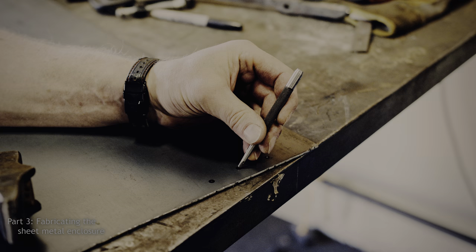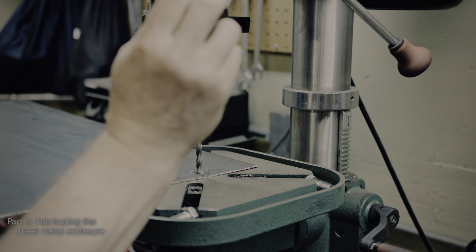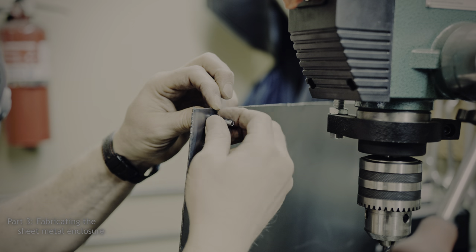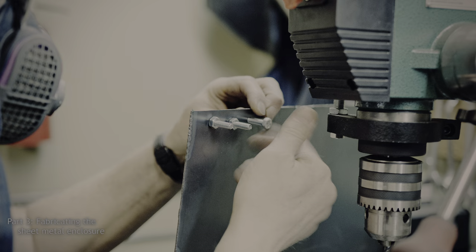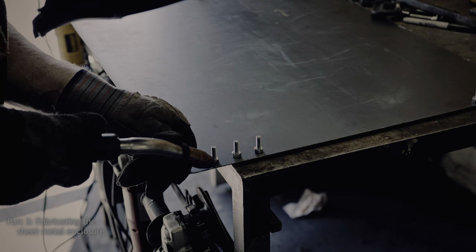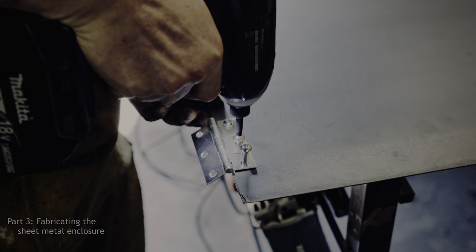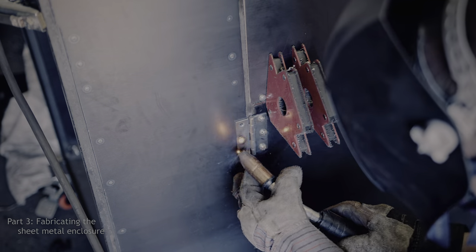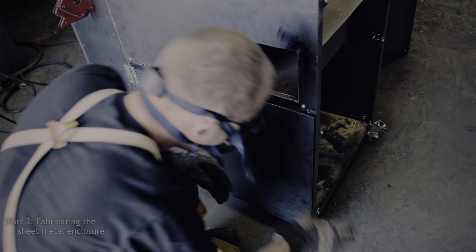For now, I am center punching the holes and then will drill them on the drill press, which is much faster than drilling by hand. I plan on welding a nut on the inside again so that the screws have something to tighten against. In principle, this is super easy: tighten the screw against the nut, and then a few easy tack welds, remove the screws and done. Here is another questionable decision. I decided that I would weld the other side of the hinges instead of trying to drill and place nuts. My reasoning was that if I ever had to replace the hinges, I would just grind them off.